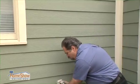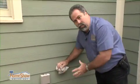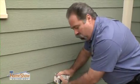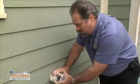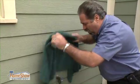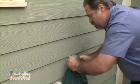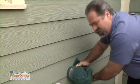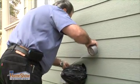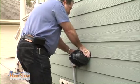Newspaper, wrap the newspaper around it, place a plastic bag over it and wrap it with a plastic bag. That's going to create an insulator on it. Another quick one is go ahead and take an old towel, get your duct tape. It doesn't have to be pretty. It's protecting the water, protecting your faucet.